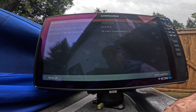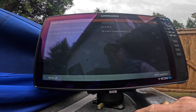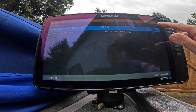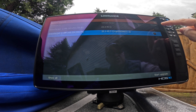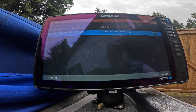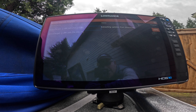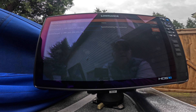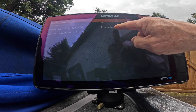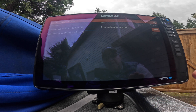You see I have both my Active Targets showing on here because I have two of them, and we can upload both boxes at the same time from the same file. If you only have one, you only have to worry about one unit. I'm going to touch both under Select. Since they're both checked, they're ready to do the upgrade right from that USB drive. So I'm going to hit Start Upgrade. It's going to show you the process in real time — it's extracting it from the USB drive and does them one at a time. Even though this says 100%, it's not done — it's synchronizing the file systems now. You'll go through several steps, and this is why I'm showing you this real time, because you do not want to interrupt this process. Some people see that 100% right away and just shut it down, and then they have problems and don't understand why.